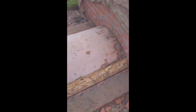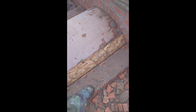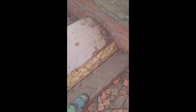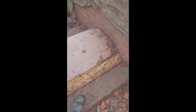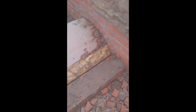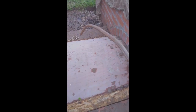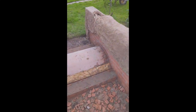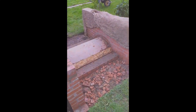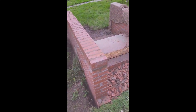On top of the wood, the first layer of concrete will go on and it'll support just resting on top of these brick walls that are six courses high and they go down to the concrete pad as well. I'll add some concrete reinforcing bars, some rebar into the mix. I've got a few of these, so I'll put them through as I lay it. And then I'll do a second course using pig wire, chicken wire — that sort of stuff. It's got a galvanised wire; it's just added a little bit of extra strength to it. Not that you really need to, but I might as well if I've got it lying around.